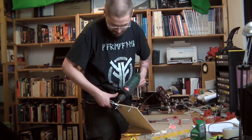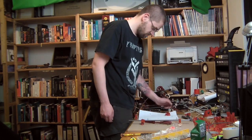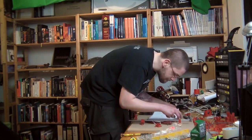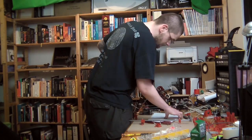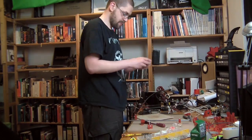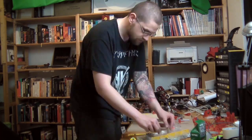For example, the bar clamps you see on the sheet right there have elongated holes, so that if your drilling holes are not perfectly aligned, you can still wiggle them around a bit to make sure that both of your smooth rods of the Y-axis are exactly parallel to each other. However, since there isn't really a proper manual yet — although I'm going to make one — you often end up having to backtrack because you don't know the right order of things, and it's really easy to forget to add some stuff.